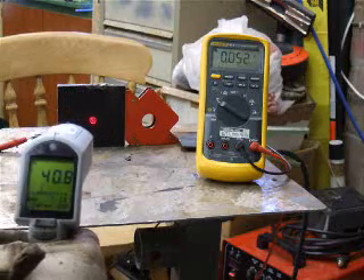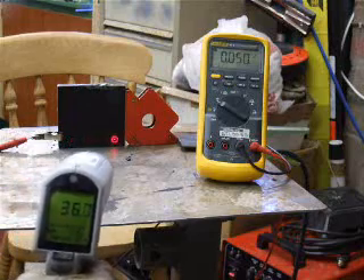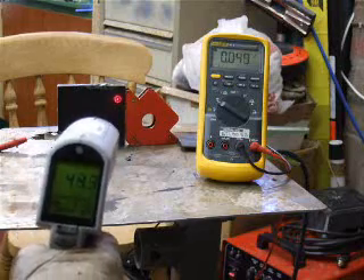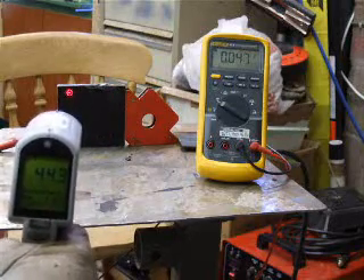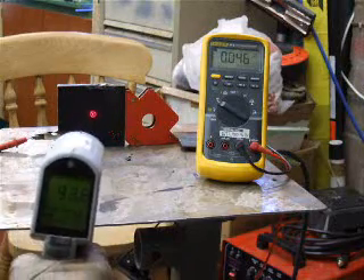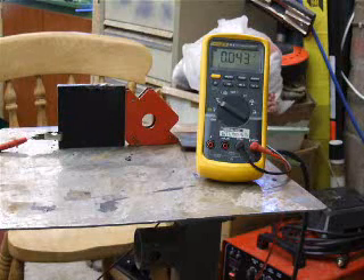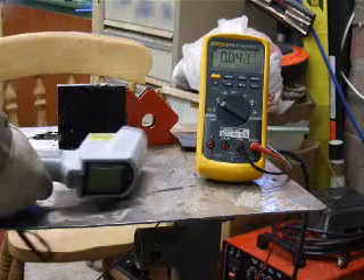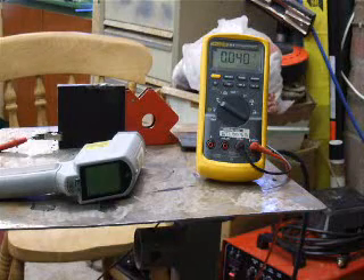47 at the top there, maybe not quite as much, so about 30, 36 at the bottom, and about 42 in the middle, 46 at the top. So there you go, we can work out an average from those readings: 44, 45, 37, 37, 40. So I'd say about 40 degrees average — we've got about a 20 degree average rise in that piece of steel, which is 90 cubic centimetres in volume. We'll pick up from the video what the voltage was, and I'm just going to do a quick check on the current with the current clamp to make sure we know what the current is.